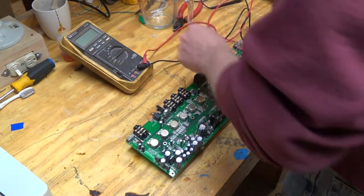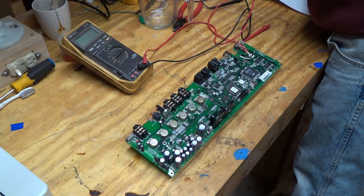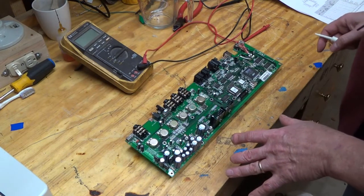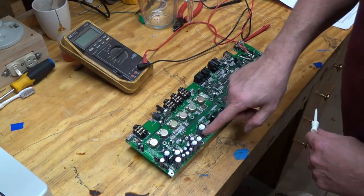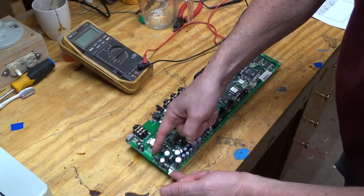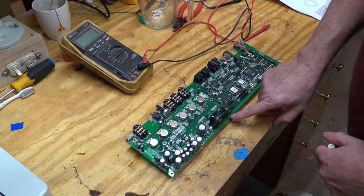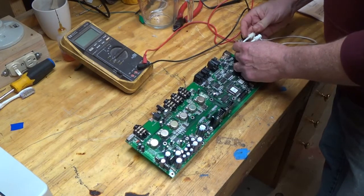but everything's really clearly marked on the circuit board. And it's interesting because this requires an AC power supply, a 9-volt AC power supply, and so the power really comes through a voltage doubler through here, and then comes out here, and you've got minus 15 and plus 15 DC coming out of this end of it, and then you've got a regulator for 3 volts, 5 volts, and 8 volts. So it's kind of interesting how the power is working on here.